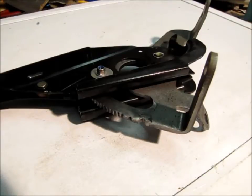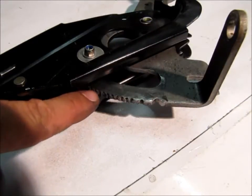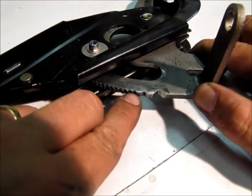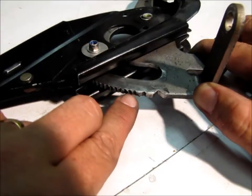In this video I want to describe how to fix a broken ratchet on a BMW E36. This model is from a 328i, around a 95 model, but it's a common failure and weakness. This is a good example of BMW being able to learn something from simple cars like the Golf 1 — they never seem to fail. What's happened here is the ratchet teeth at the front end are still fully formed, but from the place where it always gets used, the teeth are totally ground away over time. They've just chosen steel which is too soft.